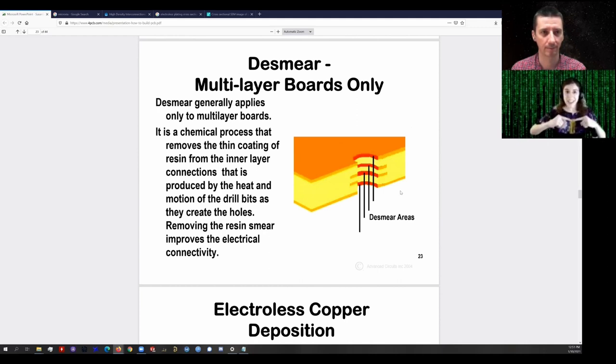So the first thing we have to do is render the insides of the holes — all your through holes, all of your vias, and if you have edge plating, the edges of the board as well. If you have castellated holes, which are really just fancy edge plating in a scooped shape, same thing. We need to render all of those surfaces just somewhat conductive so that we can then electroplate. But that still leaves us with the question: how do you get copper to stick to fiberglass? The answer is it's a relatively long, involved chemical process — one that I actually did as an experiment myself when I made my own printed circuit boards in undergrad, spending a lot of time reading patents and papers to deeply understand it.